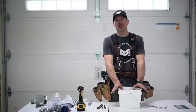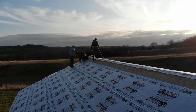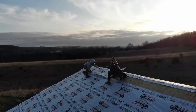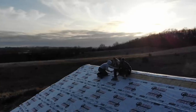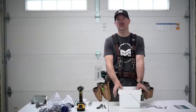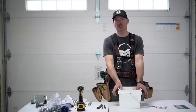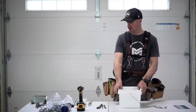The only thing we add over the roof sheathing is synthetic roofing paper, which we just staple down. We don't use cap nails because we're putting metal on it and they'll show through. Make sure the staples are nailed flat because they will show through the metal if sticking up. Another option is ice and water shield over the whole roof — no staples, costs a bit more, but screws self-heal around the material when you run them through. It's pretty heavy material, so it's a good option.